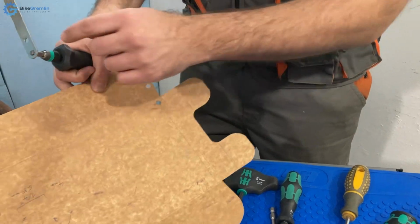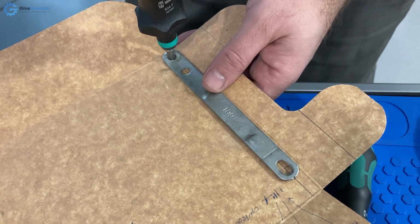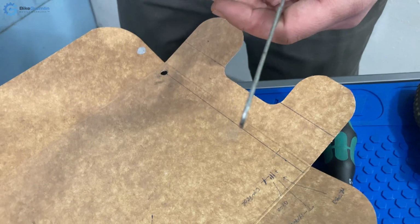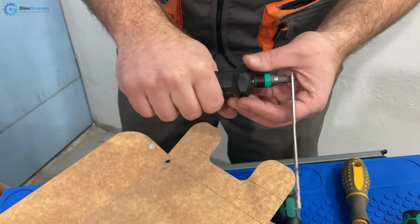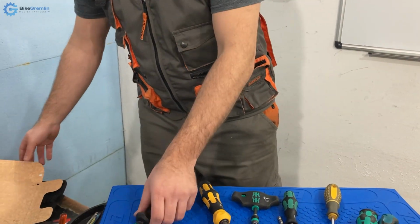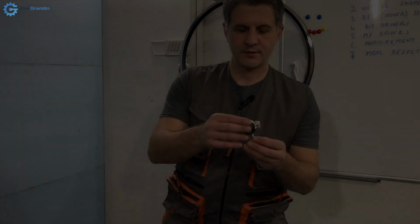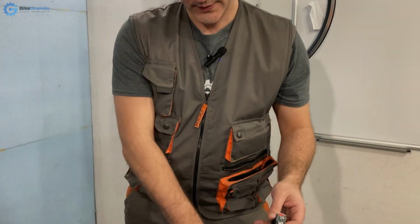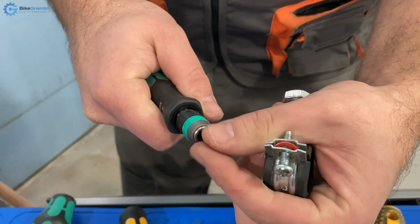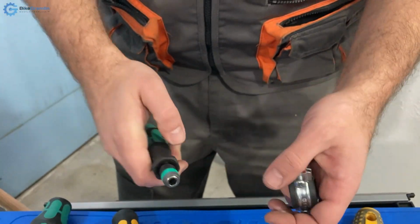So I made this bit protruding, and I used the cardboard to put it in place and measure the amount of sloppiness. And I also made a system with a grip to hold this locked in a vise. I will show it now just for giggles. Give me a second. This is what I used to hold this in place, screw them in and hold this in a vise so it's fixed, and I'm just measuring the slop of the mechanism, not the handle, because if I held it in my hand it was not precise enough.